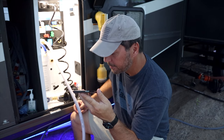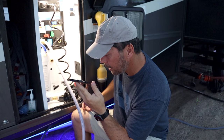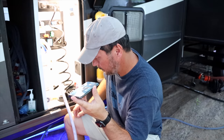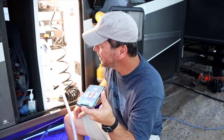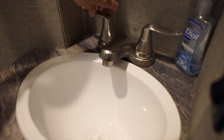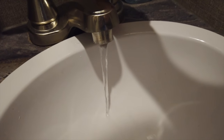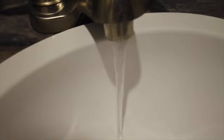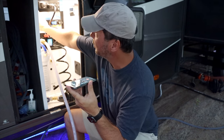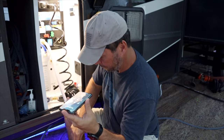Let's do the hot water first — I want to make sure it doesn't actually get hot. You don't have to touch it because there'll be bleach water coming out. Go ahead and open up the hot, turn on the pump and water should come out. Let me know when you smell bleach. Okay, can you turn it off? Go ahead and turn the hot water off and turn the cold water on. I already smell bleach now — the water coming out of the faucet is bleach water. The lines are pretty small so it got there quickly. Air is coming through now — if it smells bleachy we should be good.